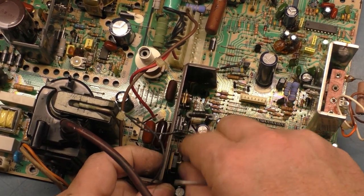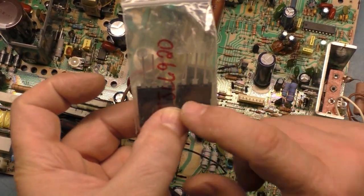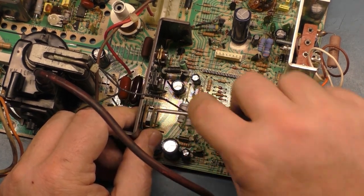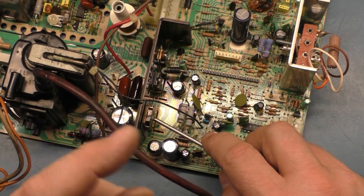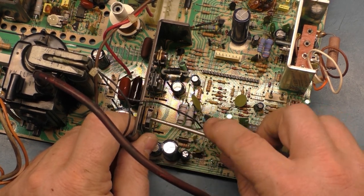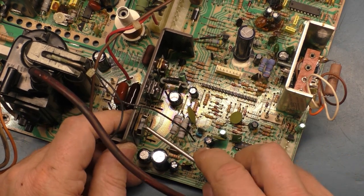And we're going to be putting in one of the customer-provided FJL 6920s. These HOTs are much more robust, and it takes a lot to take these out. So if you take one of these out, you've definitely got something wrong. I can't tell you the number of times I've replaced a bad 3688. Because if you look at Arcade Parts and Repair, the HOT that's called out for use on the 5000, the 2000, the 7400, 7500 is a C3688. But these came with a 3686 from the factory, and the 3688 is supposed to be a better version of that 3686. However, I find that I've put some 3688s in here, and they blow, and I can find nothing wrong. I put one of these in, and they last forever. So I'm not a fan of the 3688s.